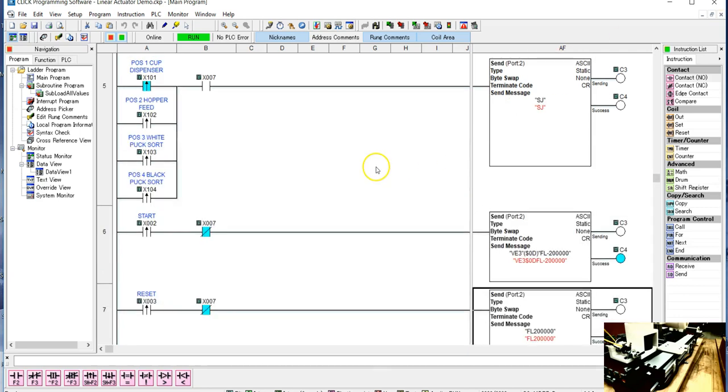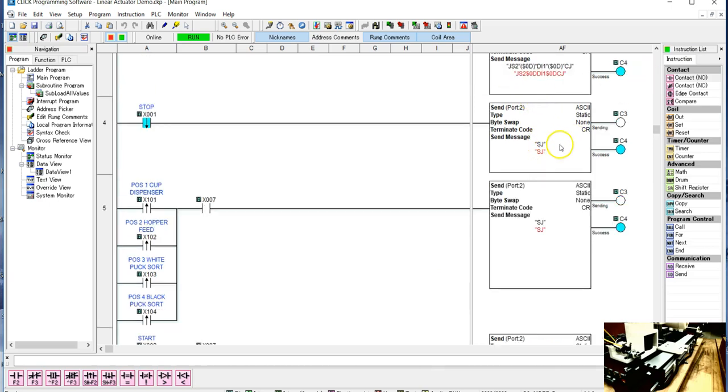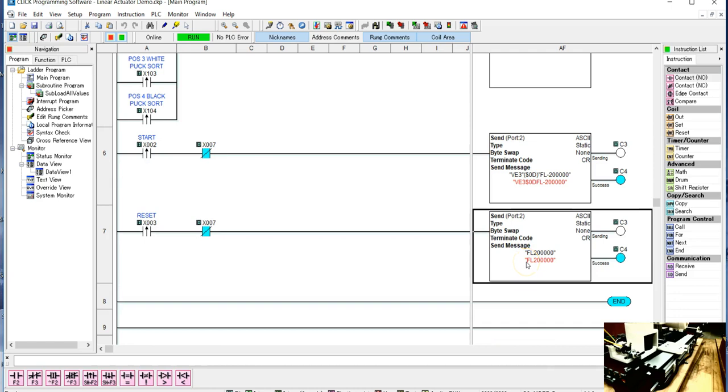Now we haven't tried it with the stop push button, so what I'm going to do is press it and send it towards the sorter end, and I'm going to hit stop. And the stop is totally ineffective. I'm going to do the same coming back towards us, and I'm pressing stop, and it's not doing anything. Now, before we were in the single sensor design, we were in this jogging mode. So when we want to stop it, since we are jogging, we want to stop jogging. Now, that is not going to stop it when it's in this fixed length mode.